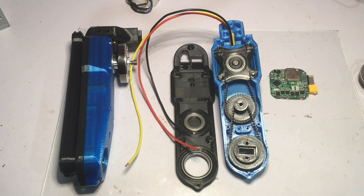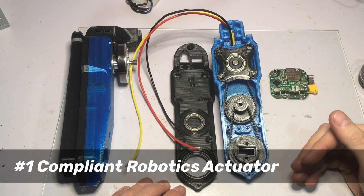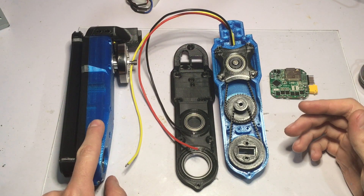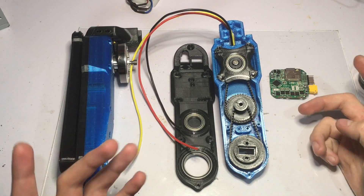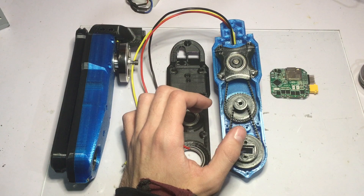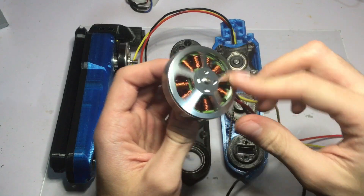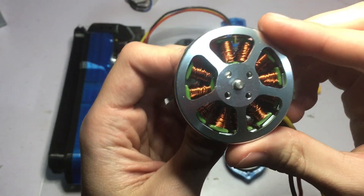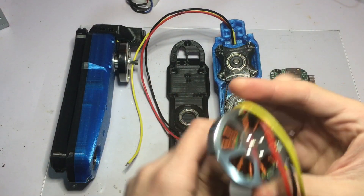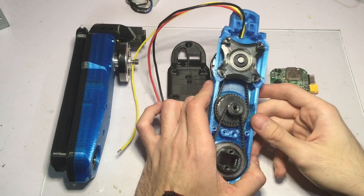This is my journey to building a brushless-based quadruped robot. What I've got here are the basic actuators that are going to make up the robot. Version one had different size belts than the ones I have now, and this is version two that I am just finishing up building. This robot will use very cheap brushless motors I found online. These are not that great — the winding is not pretty and the materials sometimes feel cheap — but they will work just fine for this application. In the actuator we have a double-stage belt reduction.